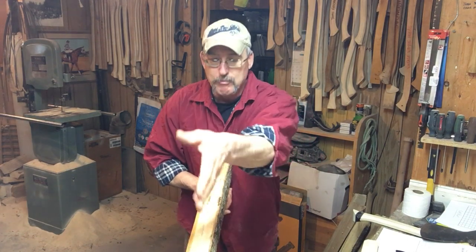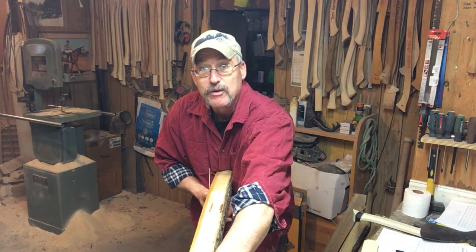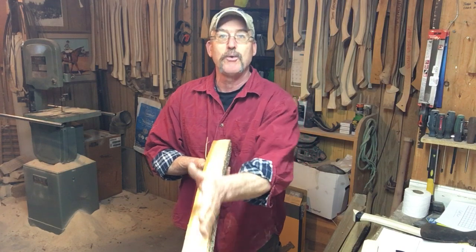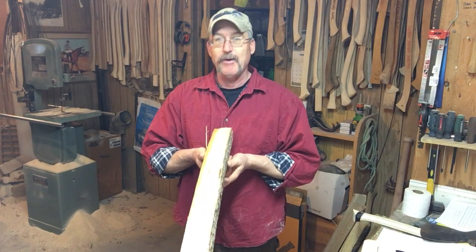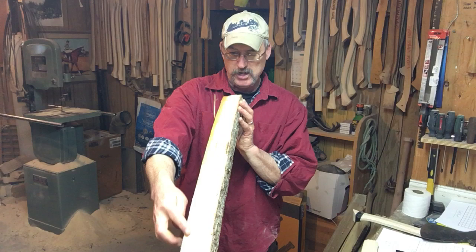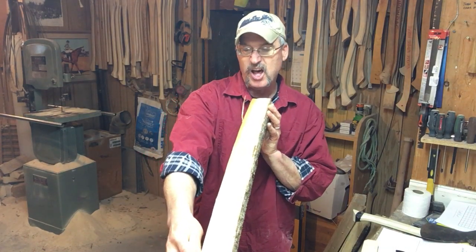So when I look down the bottom, the axe butt of the head is going to be down here, and the blade is on the opposite side, so it's going left there. So this is how the wood is going to be oriented. Now I want it over 32 inches. So the bend in this wood, it's straight to about here, and then it starts bending a lot.